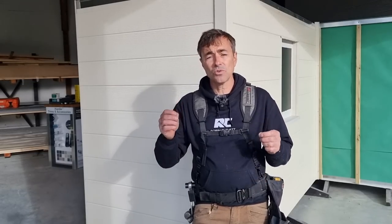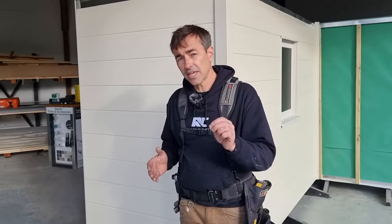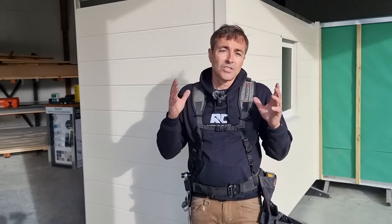Secondly, people don't plan the job out enough and they don't work out what they need in good time. That means ordering the right quantity of material — it's no good just working out the square meterage. Sometimes you need to look at an elevation and say how much will I get left out of a board, will there be many joints, and can I use the offcuts elsewhere? Spend time on your drawings, measure up on site, and work out where you're going to use the lengths. The lengths come in 3.6 meters, so many houses are no more than seven meters wide, meaning it's never more than a couple of boards wide. Make sure you order the right profiles and, if working on a block structure, use the correct width and thickness of batten.